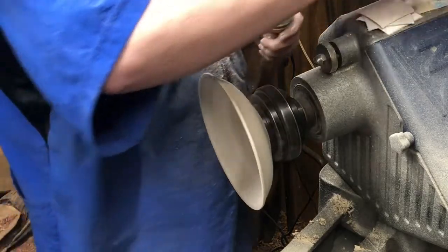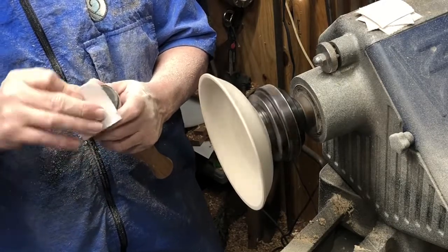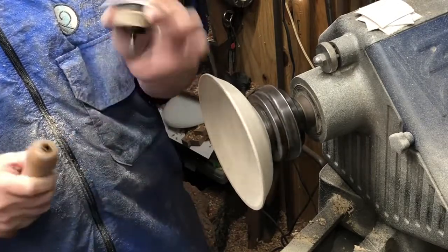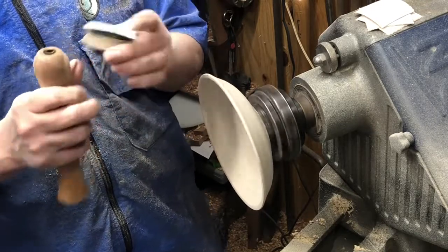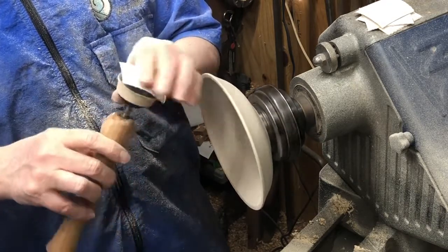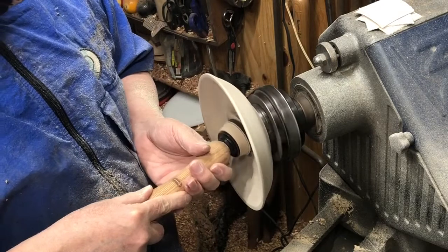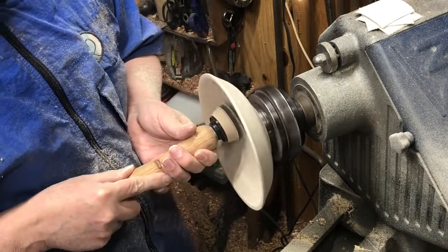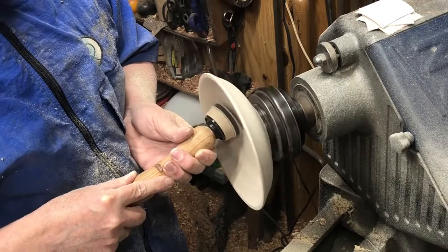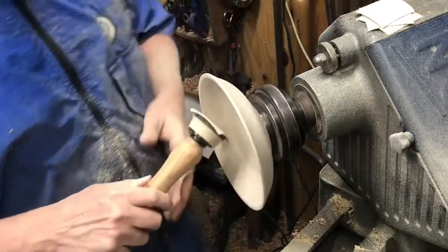The whole trick with the inertia sander is that the surface of the wood itself is what turns the sander, keeps you from having those radial lines all the way around, because it causes this to spin. This is a metal shaft with a sanding mandrel. Inside of my handle is a bronze bushing. There's a magnetic bearing on the bottom of that, so it sits down there, holds it tight. It won't fall out on its own. I have to literally pull it out if I want it out. All that reminds me, well, I'll tell you about that in a minute.